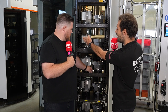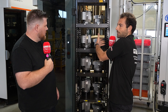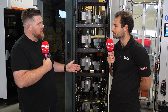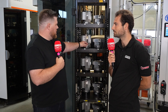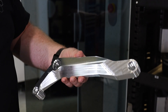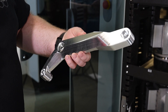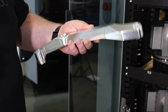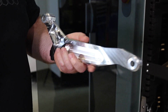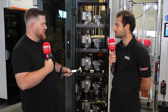What's the benefit of being able to do big parts — like the large component on the left — and fitting multiple smaller ones on a tombstone? The machine gives us the ability to do large components that we would previously have done on an op 10 automated and then op 20 manual. Now we're machining op 10 and op 20 both in the machine, automating both operations, and it also gives us the ability to do small components with this pallet changer.